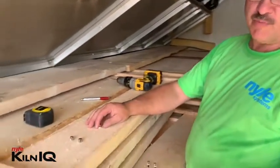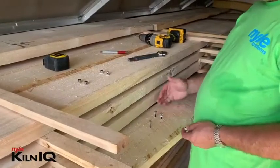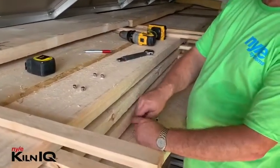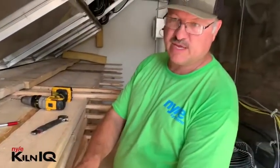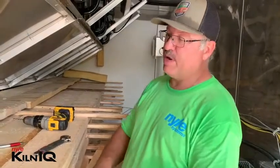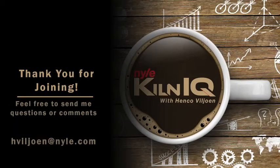For this exercise I did it on the top one because it's easier, but the second set of pins I'll be doing four layers down — that will probably give a more accurate reading of what's happening inside the stack. If you could place the pins while busy stacking, even one or two boards into the stack will give you an even better average reading. Thank you for joining — please keep your questions coming. Until next time, saw straight and dry flat.